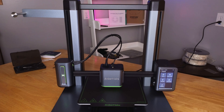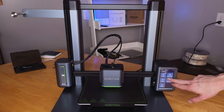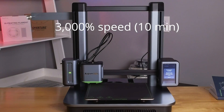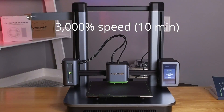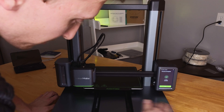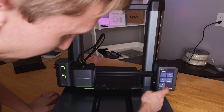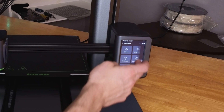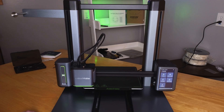Now that that is homed, the first thing you'll want to do is run an auto level. It'll preheat first and then run through the auto leveling process. The bed leveling is complete — took about 10 minutes or so. Let's check our Z offset; I've read in the community for this printer that you should add a little bit of offset, otherwise it might drag on the plate, which I don't want.